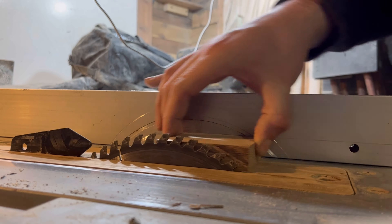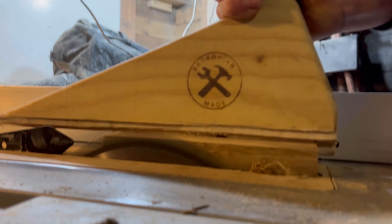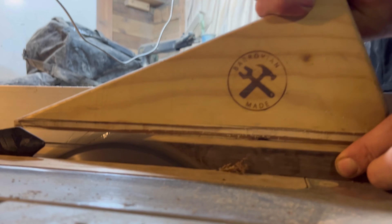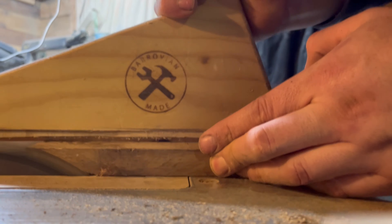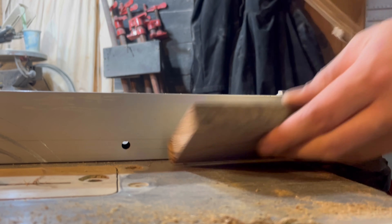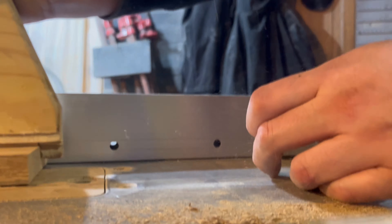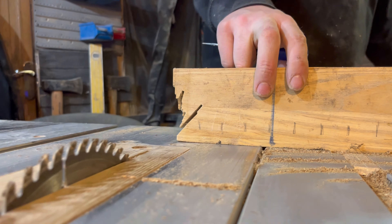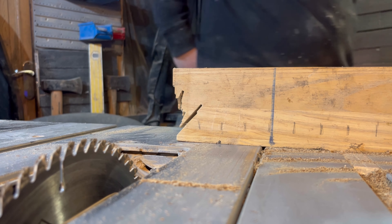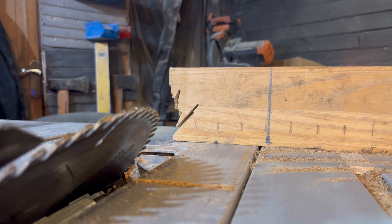The block is getting caught, and in combination with my fence having a slight taper — which I have no clue how to fix, so if anyone in the comments knows please let me know — the epoxy getting stuck really surprised me. You can see at the front and back how it's melted and stuck there. I think this is because I worked with the epoxy before it was fully cured — it was solid but not rock hard. So for god's sake, let your epoxy cure fully before working with it.